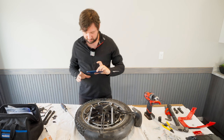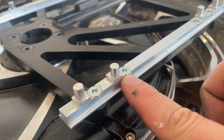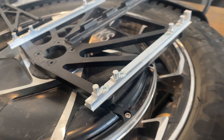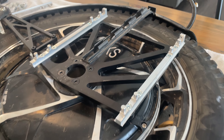There's the two rails installed. It's also important to make sure you have the right screws — these are flat head screws so they taper down into the part. If you get button head, they're going to stick up and rub. I accidentally ordered the wrong screws at first, so don't make my mistake.